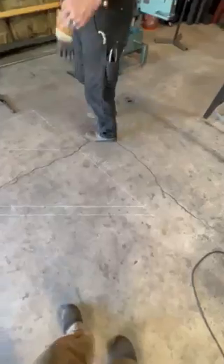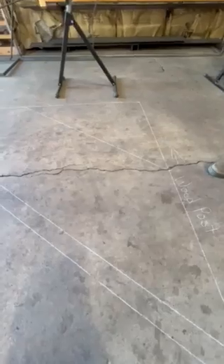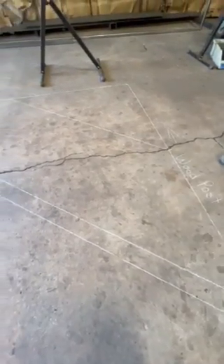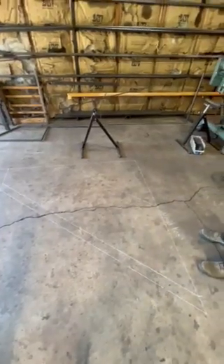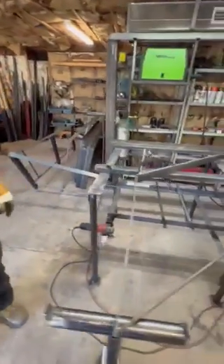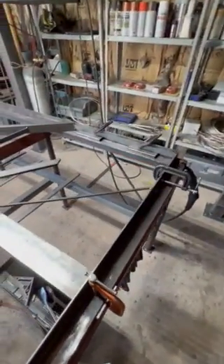So what we do in a case like this — we sweep off a nice patch of the floor and draw it out to scale. This entire outline is the insert section. This line and this line is top and bottom of railing. We draw it out, we can then get angles and measurements. Basically, if it lines up, it all lines up pretty good. Obviously this will be a test fit. Then we come over to the rail table — after drawing it out we're able to cut parts, we know the lengths.